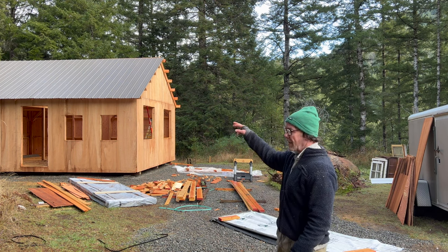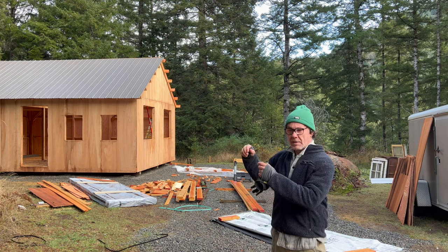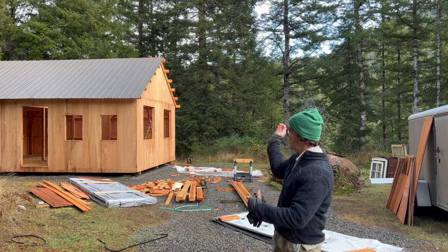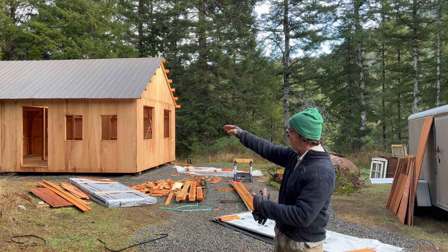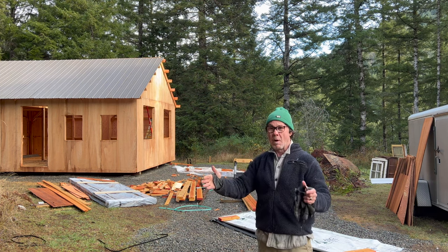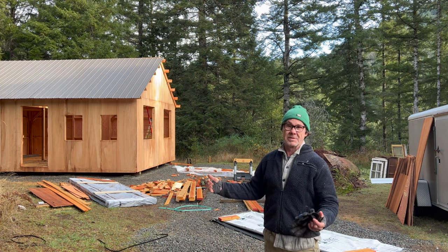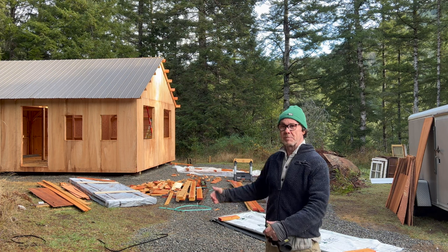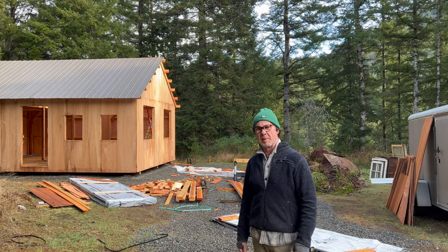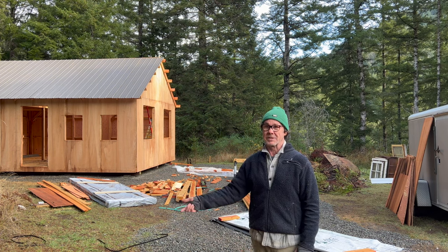And the gable end on that end of the roof actually takes a 19-inch panel. So it's eight 38-inch pieces going across and then a 19-inch to finish it off. So that's one panel split down the middle. So I missed that panel as well as a full 38-inch panel. So anyway, I just left my lumber yard and ordered those two panels. Unfortunately, they're not going to be here till the end of next week.